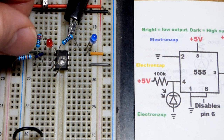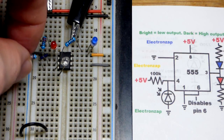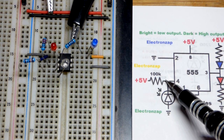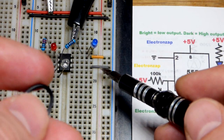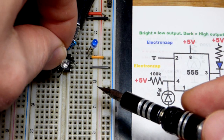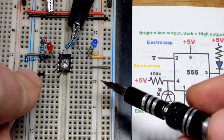Right now there's nowhere for it to go, so I'll plug in this 100,000 ohm pull-up resistor, which determines sensitivity somewhat. For the most part, the photodiode conducts really well under bright light and not well at all when dark, so the exact resistor value isn't crucial. I made this circuit a while ago — I probably tried 10k, didn't like the results, and went with 100k. There's adjustability there, but I can't speak to how much difference it makes right now.